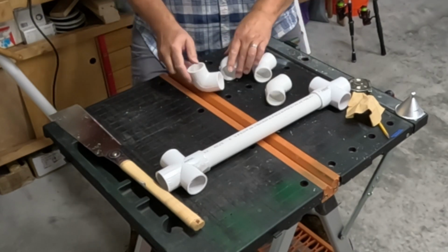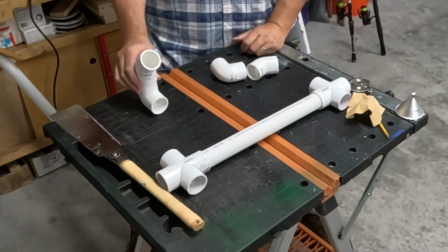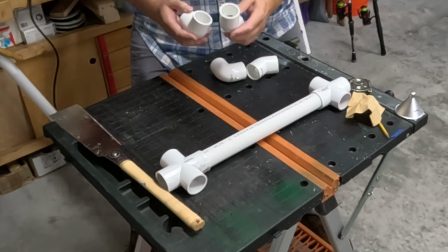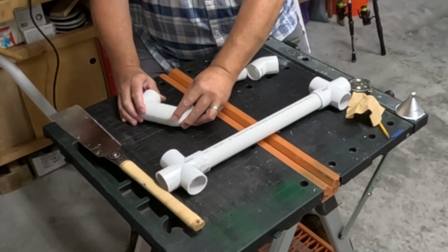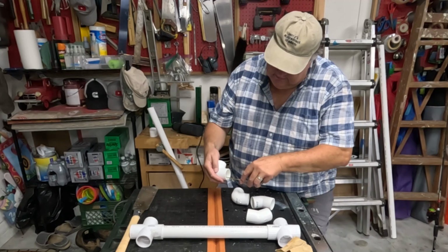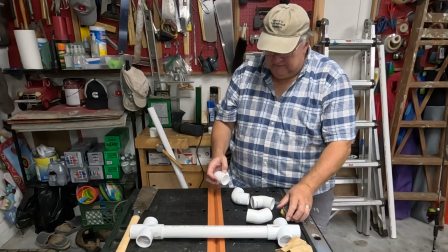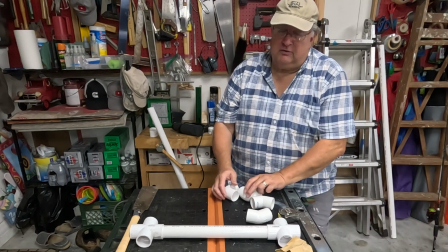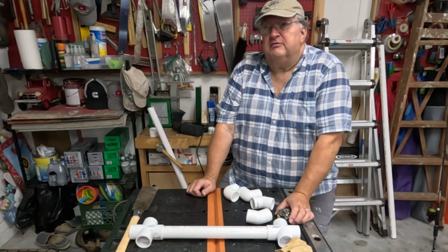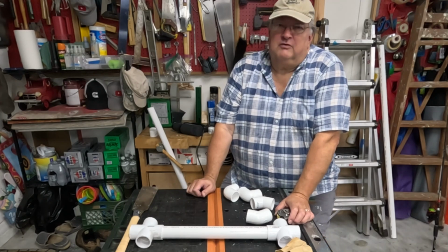The next step in our build is we're going to put these fittings together. I've got a 90 and a 45, and I want those to end up in this configuration right here, setting right about there. So all we need to do is put a short piece of pipe in between these 2 fittings. So if you measure inside these fittings, it takes about 1¼ inch on each side to have those come together. So you're going to need a 2½ inch piece of PVC, and I'm going to need 2 pieces of that, and I'll make a list of the parts and dimensions and put those in the description below.